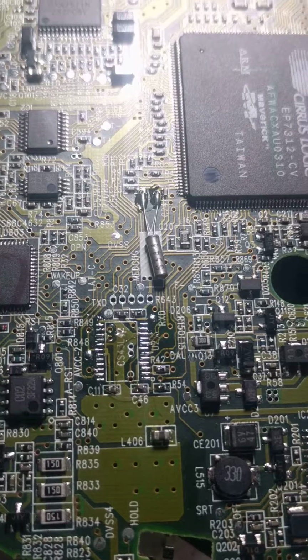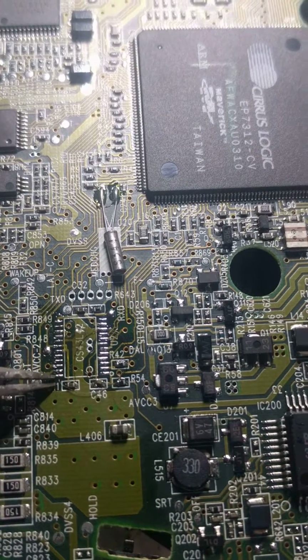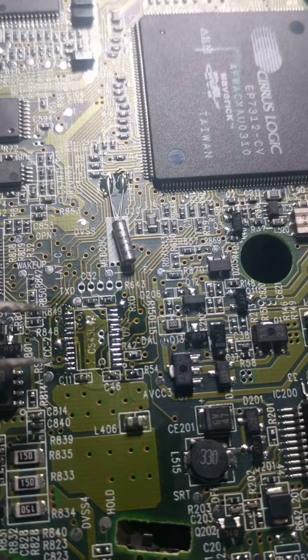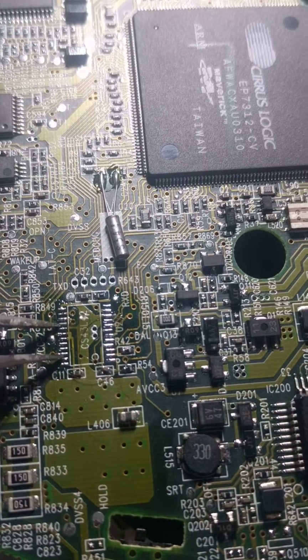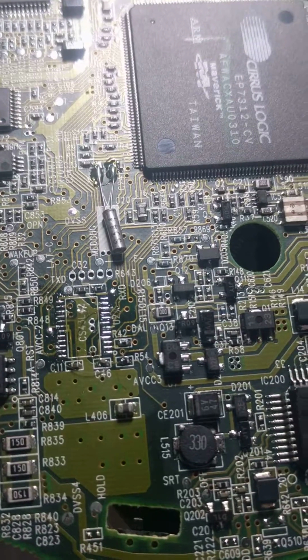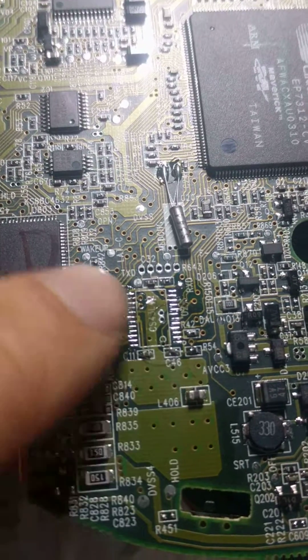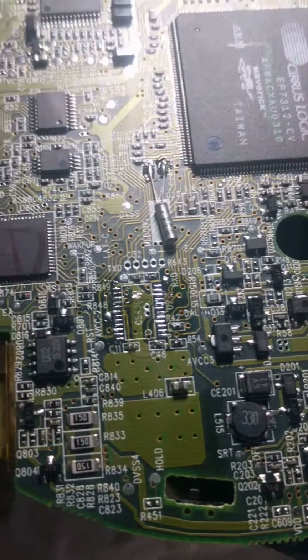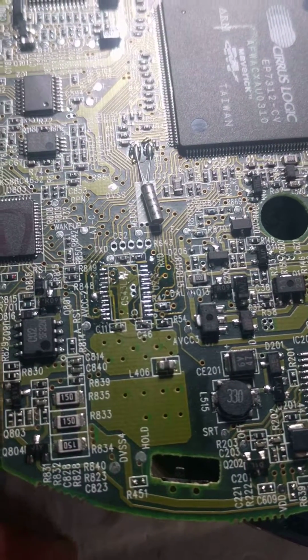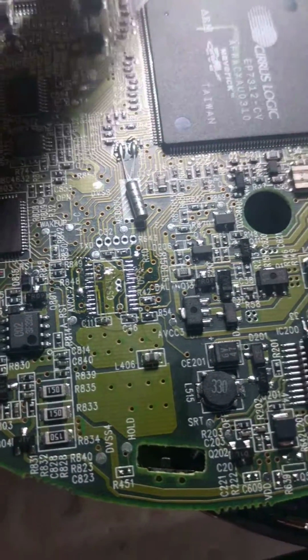So interesting thing to note, though, is when you look at my board where I took the chip out of, this donor board here, you'll notice that pin 21, which is this pin right here, 24, 23, 22, 21 is not connected, and neither is 16, which is this pin right here next to the ground plane, which is very interesting. They're not actually using the headphone output from that chip. I wonder why that is, because you actually could really benefit from dual outputs since this has dual outputs. There's a line out and a headphone output here. My guess is that iRiver didn't like the fidelity of the headphone output, and maybe there was too much THD or something like that, total harmonic distortion. Who knows? I think it's very interesting. They decided to use the line level output and not use the headphone output at all.